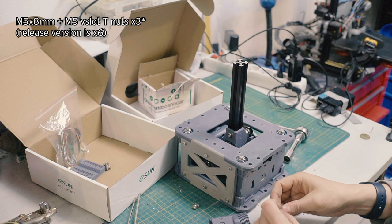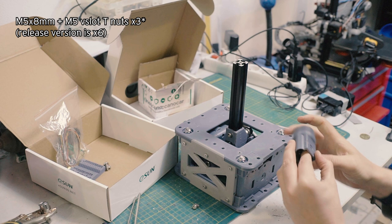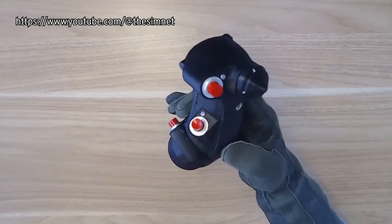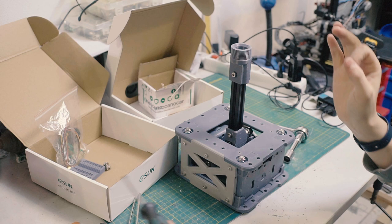Now, the reason why I was saying if you really want to use this is because I don't have a Thrustmaster grip or a VPC or anything that uses that connector. In fact, my sticks are all homemade 3D printed monstrosities or real flight hardware that I've modified to work. The mockup Thrustmaster stick is the Simnitz excellent B8 grip plans that he has online. I printed just the bare essentials of it to use for mocking up. It's a really great design, but it has a very thin outer body. So there's potential that when I test this with very heavy springs, it'll snap off, which will be very, very funny if that happens. Anyway, it's all pretty straightforward how to put these on.